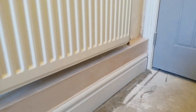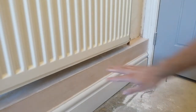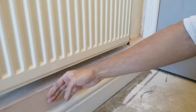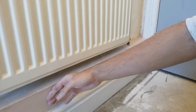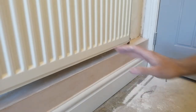Hey guys, Liam's DIY channel here, and today I'm showing you how to seal bare plaster ready for painting. You may wonder why we have to seal it. It's a simple job but very important, because if you don't and you apply normal paint, the plaster will literally just suck all the moisture out of the paint, and that's how it starts flaking and peeling — then you have to sand it all down and start again, and it's a whole big mess.